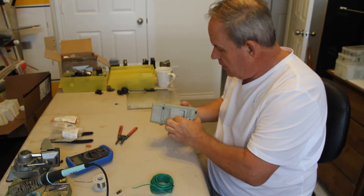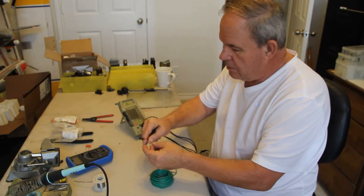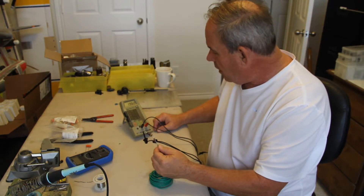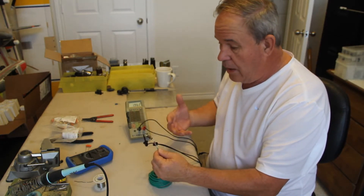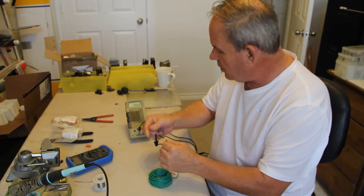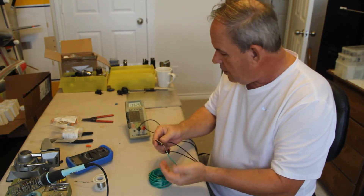I have an older Fluke meter here — this thing's still hanging in there. I'm going to go ahead and just show you measuring your resistor. See these little mini clips that go onto the wires really easy? Actually, these are called the mini clips — the micro ones are too small for what we're doing. Obviously it's a 2K resistor. This is a manual range. You can enjoy auto range meters, but you have to look for the little K and the M in the corner to make sure, if you read mega ohms or kilo ohms, it can be a little confusing. Also, if you put your fingers across them in auto range, you'll get a reading — it'll actually be reading through your body or across your fingers. But this one's fixed range — you can just select whatever range I think I'm going to be at and it makes my measurement.